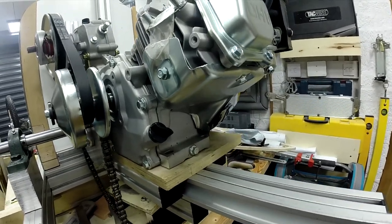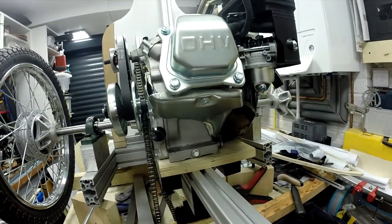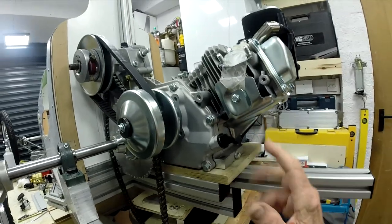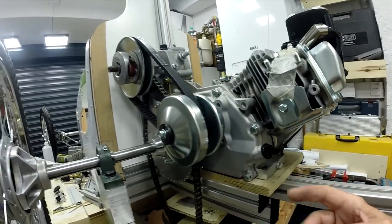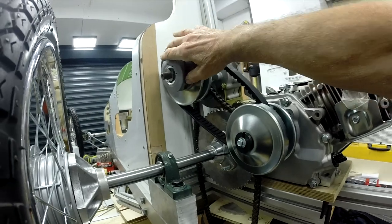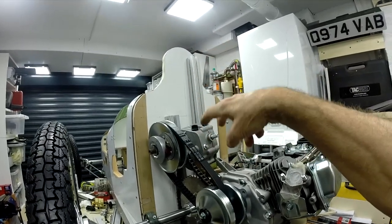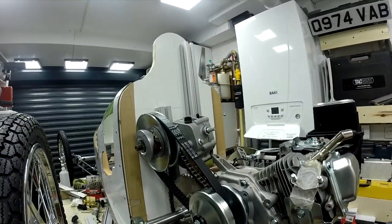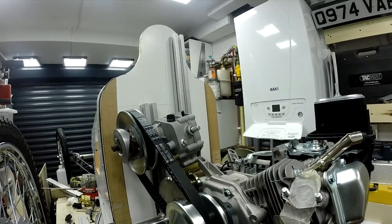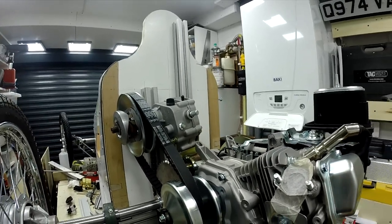into there. There's a 40mm on the other side that will go in and bolt up as well, and that whole lot will then become basically a T-section in aluminium, all bolted together, both top to bottom and side to side, and bolted into that back frame. So I think the whole thing will be pretty solid at that point, and it will form an L section with a couple of vertical pieces there, which will carry the gearbox and probably a disc brake caliper, and anything else I need up there, petrol tank, things like that. So it's all coming together quite well at the moment, I think.